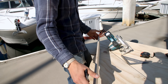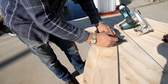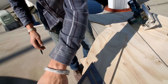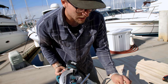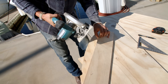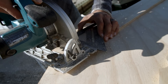This is our top piece. Right now this piece is straight — it's flat like a bin. We're going to make a bunch of relief cuts at 90 degrees all the way down this piece. Then I'll come back with my saw, set my depth to the perfect level so it's not cutting the piece in half — just cutting down to about there. That way the relief cuts make it malleable so you can actually bend this piece of plywood. It's bendy — cool, huh?